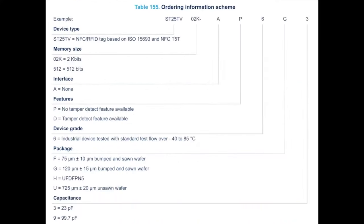So that was a cool new feature. Coming up, a couple of different setups — either 512 bits or 2 kilobits, different package sizes, different capacitance. The capacitance is going to affect the maximum antenna size, so you want to match the antenna to the capacitance. You can't tune the capacitance, but you can pick which one you want. Most of the time you're going to get tags that are pre-formatted. You're not going to worry too much about creating that tamper resistance wire — you'll buy ready-to-go tags, like from Tag Stand, who is the partner for ST.